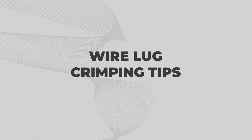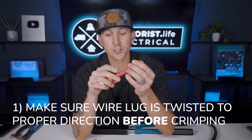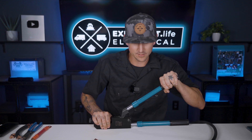Wire lug crimping tips. Now that you've got a high quality wire lug terminal that will last for years to come, here are some additional helpful tips. Make sure your wire lug is twisted to the proper direction before crimping — once it's crimped, the wire might be hard to twist so the lug faces the right direction to attach to the component, and this is most critical with short wires. Also consider clamping your crimper to your work table. When you're putting pressure on the handle trying to crimp the lug into place, if it's not clamped down it's easy to let the crimper fall over and it will really smash your fingers. Ask me how I know.